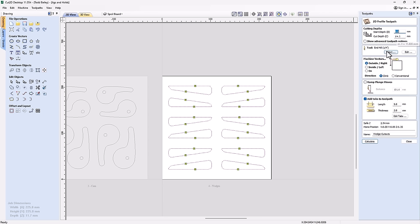Now in this case, I didn't really have anywhere smart to put these tabs. I could have put one at the end, but I didn't think that was going to hold it in place. So I did have to put one on these flat edges. So I'm just going to be really careful when I sand these down that I don't gouge my edge or leave a little lump behind. And if I do, I want to make sure it's very, very minimal. And if anything, I want it to be more of a recess. That way I don't have an unflat surface to put two wedges up against, or this side against my material. I want to make sure that it's as flat as I possibly can.